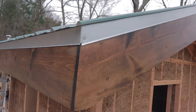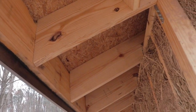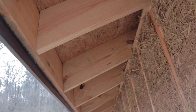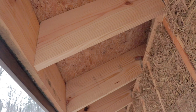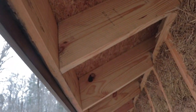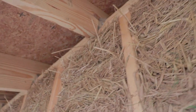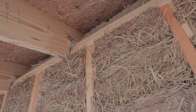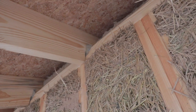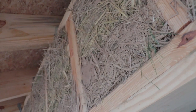Underneath here is still unfinished — I have not installed the soffits yet, so you can see the actual structure. You see the rafters as they come off the ridge beam to the middle of the building, and then there's this rough fascia board that connects them all on the ends. The rafters sit on top of that top plate and have a cut called a bird's mouth cut, which helps the rafter set on top of the top plate. Just google how to do a bird's mouth cut — it's a common framing technique for roofing.